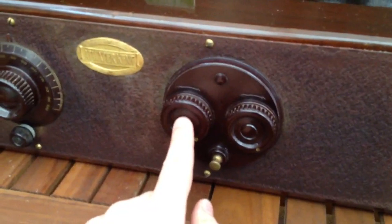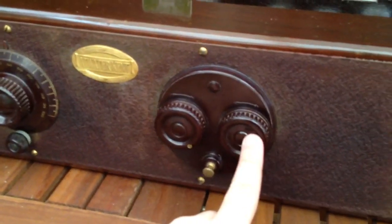I think there are about four tuning capacitors and a small tuning capacitor right in that corner — you can't see it without me being an acrobat, but take my word for it. This one here is for the antenna tuning, this one is for the main tuning, and you've got two rheostats — one for the four RF stages and one for the detector.